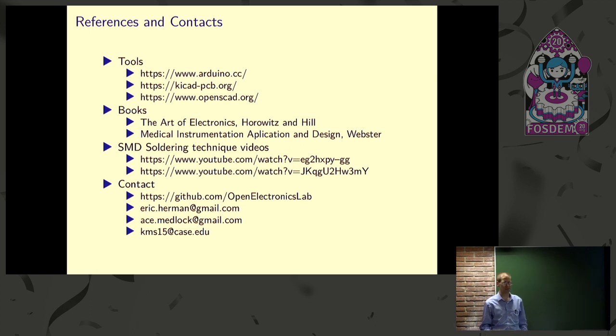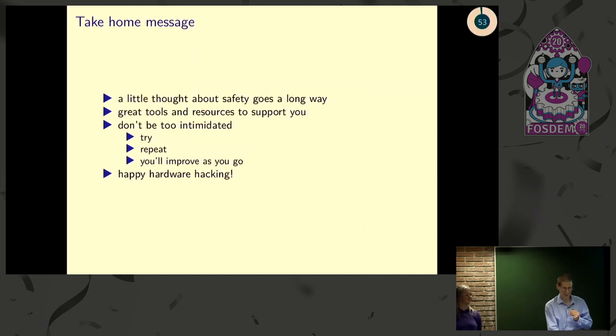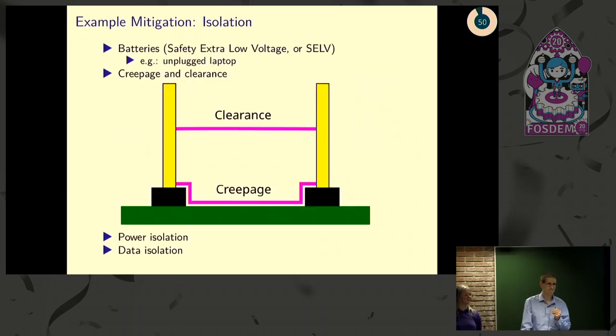What was your rationale to have that good galvanic isolation? Speak into the mic and repeat the question. So he's showing us a version of our board, which is great to see. I believe you're pointing to the two DC to DC converters on the bottom for our galvanic isolation, and the isolation buffers. You have this very clear interruption of all power planes between the ADS and the Arduino? Yes, that is an excellent question.